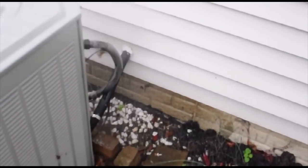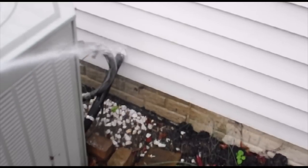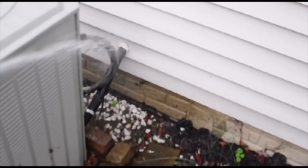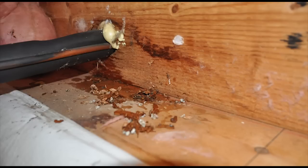Soon after, we started to water test the back of the house vinyl siding and all mechanical penetrations such as AC suction line, electrical service, and cable, using the water hose. We did find that water leaked at the mechanical wall penetrations; however, these were below the dining room moist area.